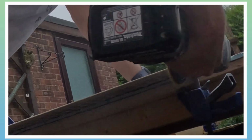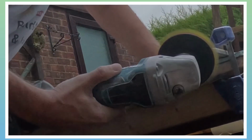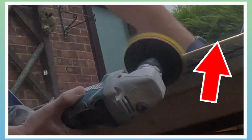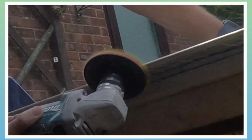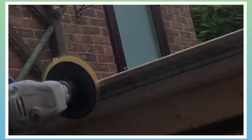So I'm gently polishing it now, and I'm leaving about 1 millimetre of material on the edge, because if you go right up to the edge you'll start to chip it and it'll look odd when you fill it with the resin. So I'm using 100 at first, and then when I get close to that millimetre of material left, and the mitre's overcut as stated before, around about 50 degrees, then I'll go to the 200 or the 400 polishing pad and gently clean it off.